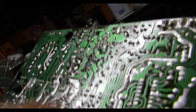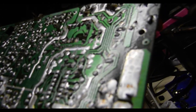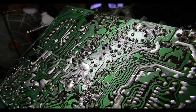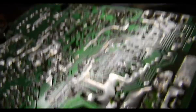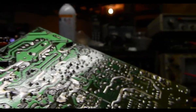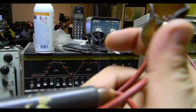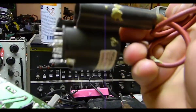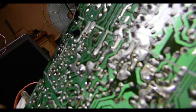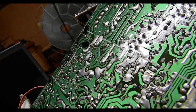But I'm gonna go through and check a whole bunch of other stuff too, because there's probably more things hidden here that are just that bad. And if you've made it this far and you think you might have solder joint problems — for the love of God, don't reflow it. For the love of God, don't reflow it. That's how my old one died because I tried reflowing it like everything else. That's the old flyback transformer from the one I reflowed years ago — basically everything in the PCB did that. They weren't meant to handle high temperatures like newer stuff is.